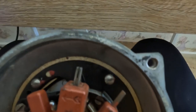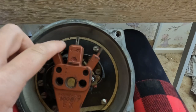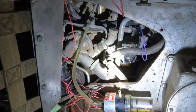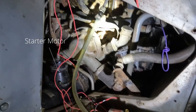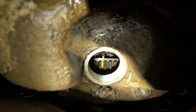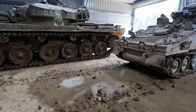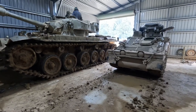The next step is to reinstall the magnetos. As previously explained there are two magnetos, both marked differently — one intake and one exhaust — corresponding to timing marks found on the flywheel. In order to time the engine and the magnetos together you need two people. One person installs the magnetos and turns the engine over using the starter motor. In a rare stroke of genius, Meteor and Spitfire starter motors can be hand cranked from the top. The other person must lie under the tank and check for the timing marks as they appear. With the engine and magnetos timed correctly we were now ready to move the tank to its new home at South Gippsland Tank Adventures.